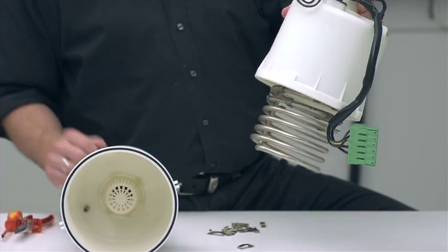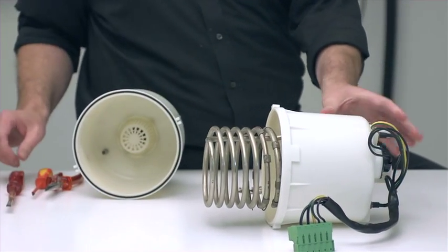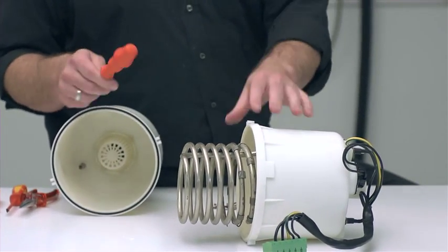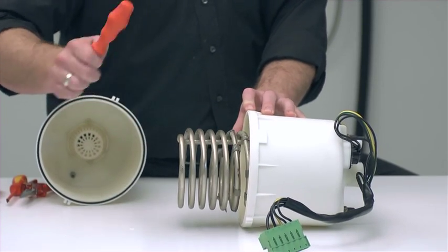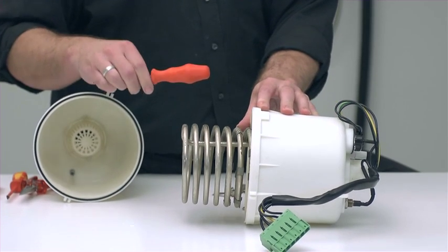And now for cleaning, I would first check how much deposit is on it. If there's a light coating of mineral deposits, I would try to go about it with a screwdriver. I use this shaft of a screwdriver. Knock around on the heater element a bit, not too hard, you don't want it to bend. And then small pieces of scale will chip off.